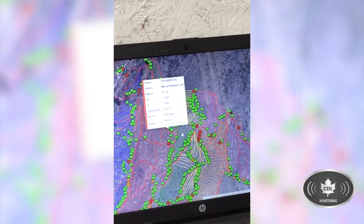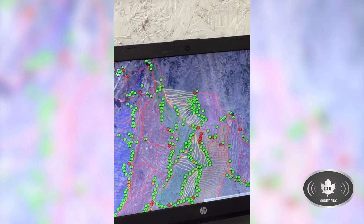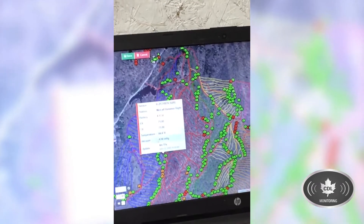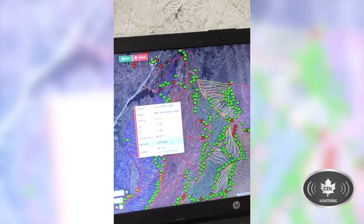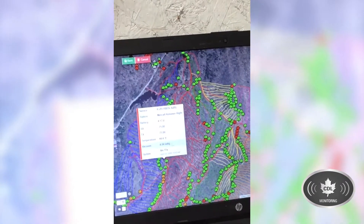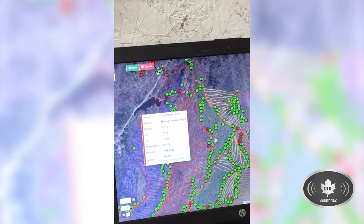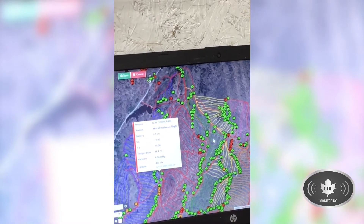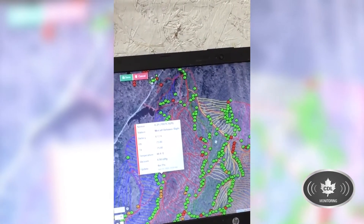We should hopefully be able to find some frost or something on the line. We've got another one down here, R29, which is at just under five inches of vacuum. We'll check that one as well and a few others, and once we get to them we'll start another video to show you what we found.